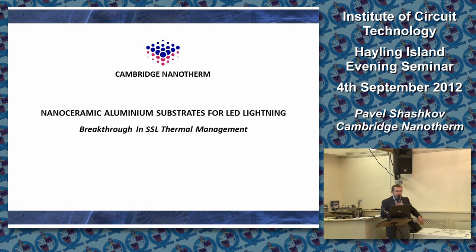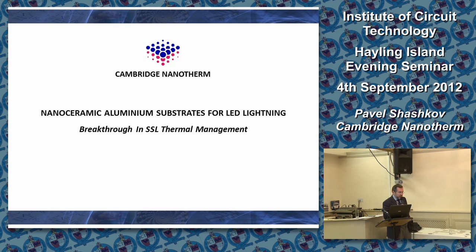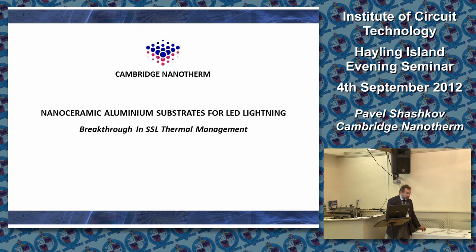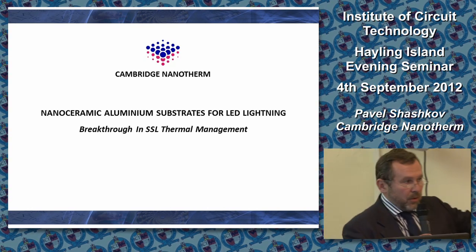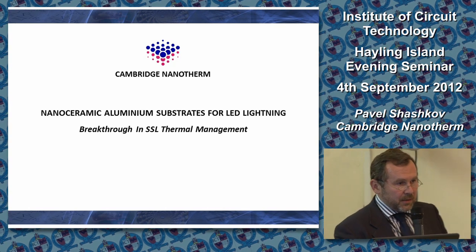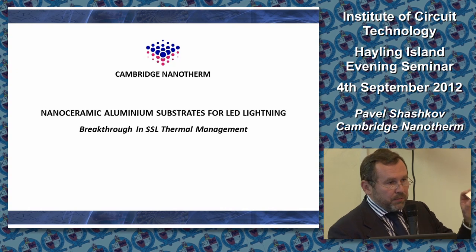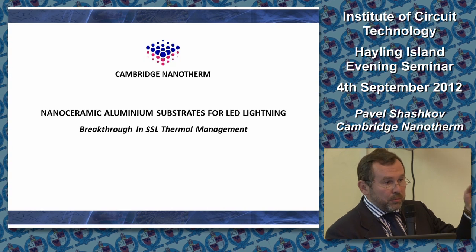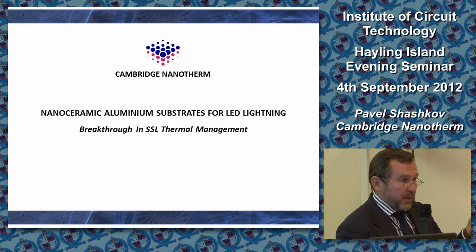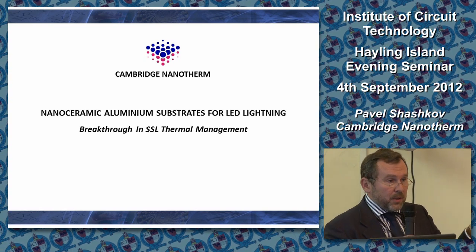I will be talking about nanoceramic aluminium substrates, which sounds a bit unusual. And in essence, it's a very simple thing. You take a piece of aluminium of any shape and form, a flat board or a heat sink like this, and you put it into a tank and you apply an electrochemical process which builds a layer of ceramic on the surface of that object. And you have aluminium ceramic, in our case nanoceramic material, a substrate on which you can build your circuit.